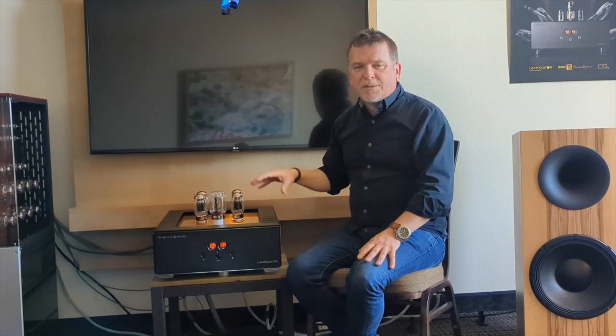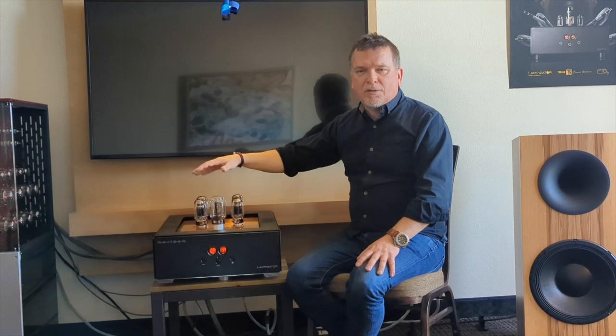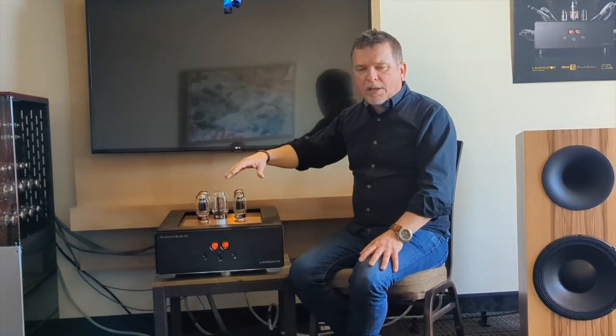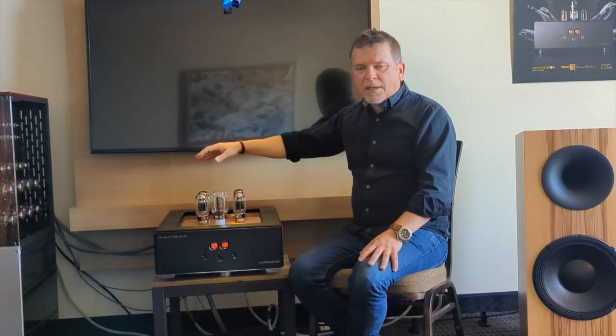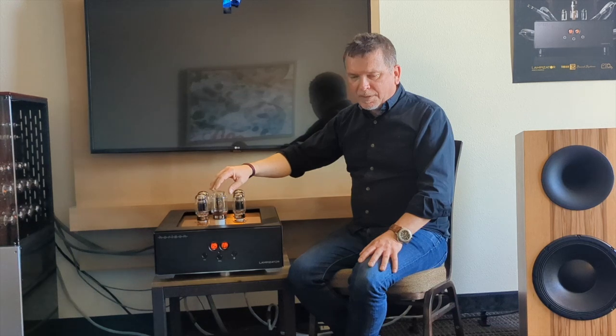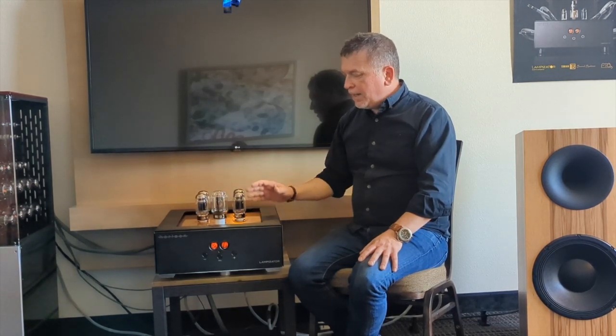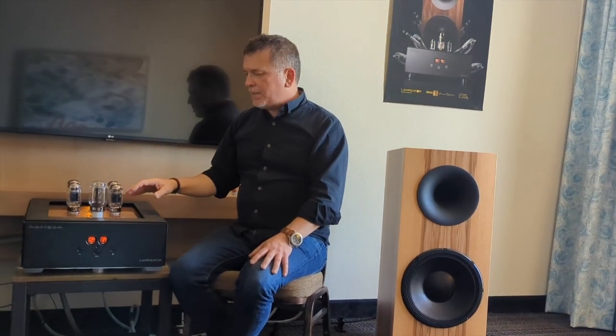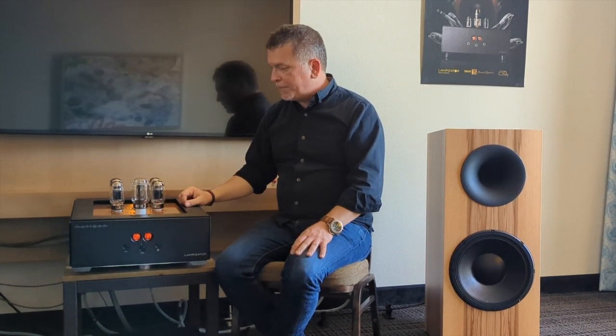So three transformers, 100 watts each. One transformer is dedicated only to the digital section. One transformer is dedicated to the tube section in all the low voltage needs, like heaters, like biasing, and the filament of the rectifier. Then high voltage, which is the most important in tube design. The high voltage that goes on anodes of all these tubes is made by the specialized EI transformer, so it's a traditional cubical shaped transformer, and it's supplying the 8 anodes of these tubes.